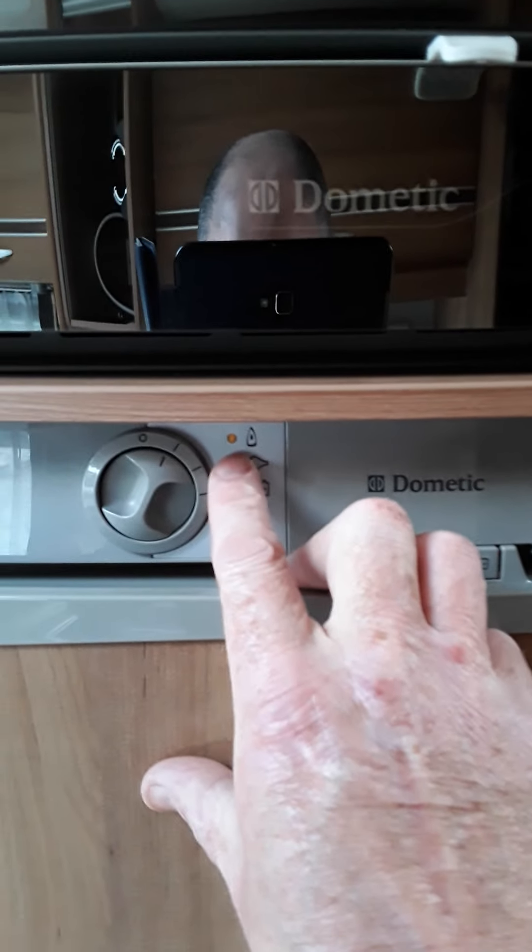Around here at your gas tanks you can see your two 11kg tanks. The hoses actually screw on with a left-hand thread, so they screw on anti-clockwise and loosen clockwise. We have a spanner left here for you as well. So to loosen you go clockwise and to tighten you go anti-clockwise.